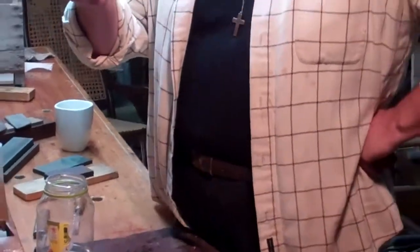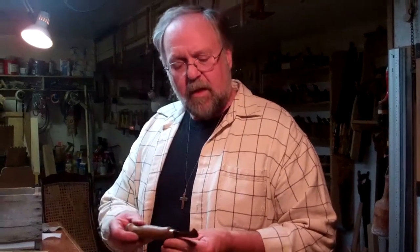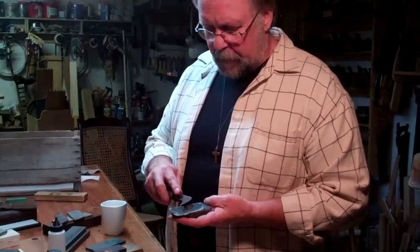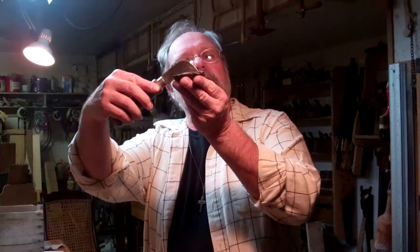Here's a different kind of knife — a utility knife, commonly called a linoleum knife or a flooring knife. It's just a knife, thin blade, beveled to both sides, but it has a complication: a bit of a hook in the blade. When I say complication — we'll take our ordinary piece of slate. You can see right under it — it's not going to work. You're going to need to do something a little different. For that, you'll need a different stone. You'll need a stone that's curved.